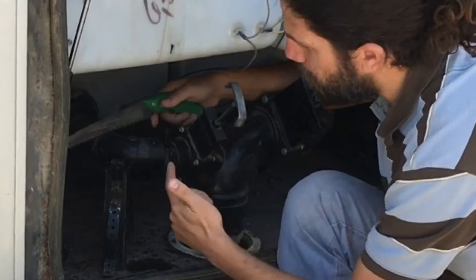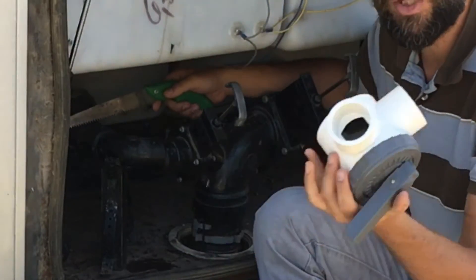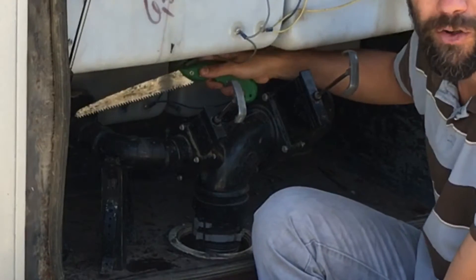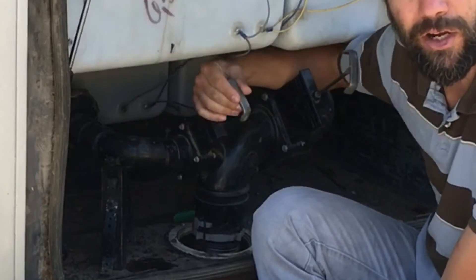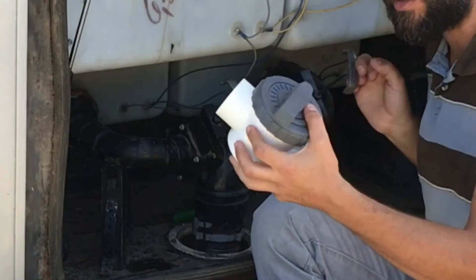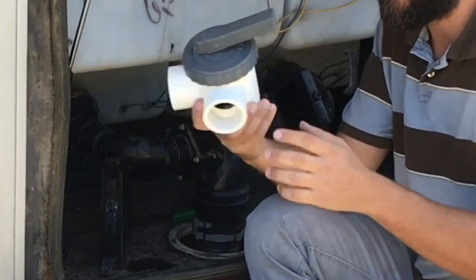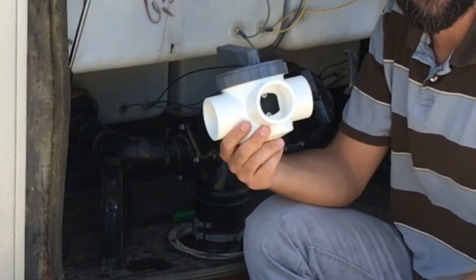What I'm doing here is cutting off this section. I figured I can pretty much fit this at that intersection where it goes from the gray water tank right into this little valve right here. So it will allow me to both shut it off from the valve and direct the water whichever direction I want. It's a three-way valve that comes with the gray water irrigation system.